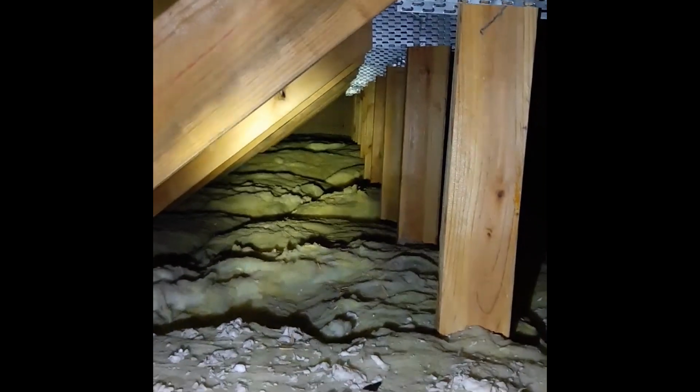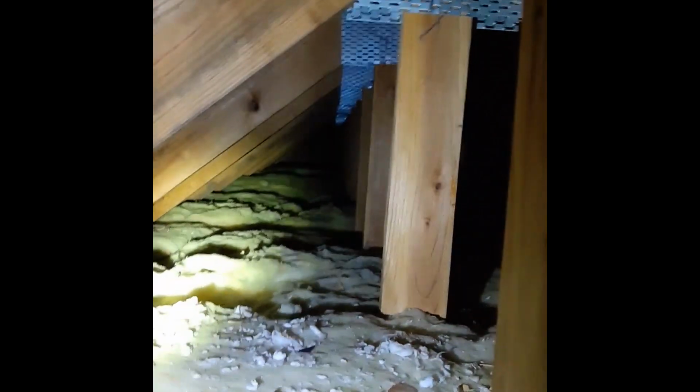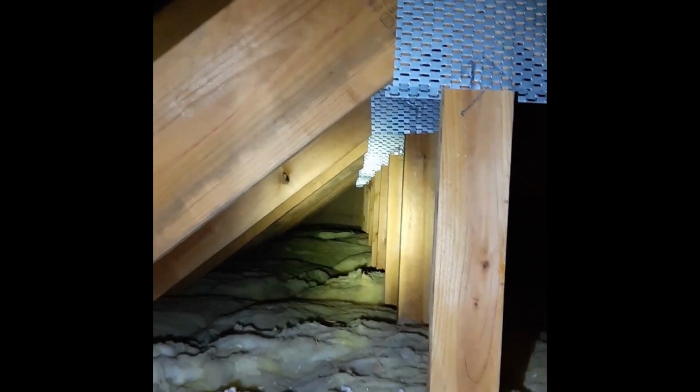And again, this is just the way the house was architected. Because of how the upstairs of this two-story was built, the upstairs technically stops right here, which means the section that we're on for the living room keeps going. And you can see right here, this line, there's a cutout. You can see right there in the middle, they cut that out, and this extends on. If I shine my light down here, you can see this goes all the way down there, which is good because there's a lot of room, and I could fish a rod through there pretty easily if I was on the underneath side of it.